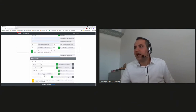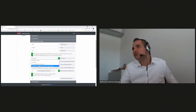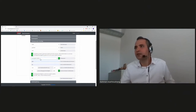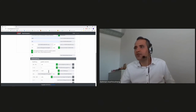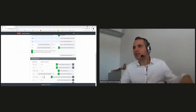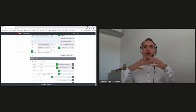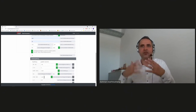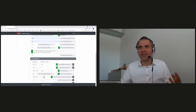And here I change, for example, the process from roughing to finishing. And then these process parameters change. You see the depth of cut is reduced significantly. The speed ratio is completely changed. The axial feed speed is completely changed. So the system considers all parameters at the same time. It offers a really great holistic view, and it can be used also for the teaching aspects.